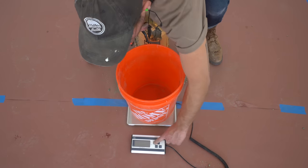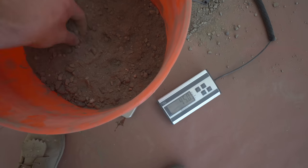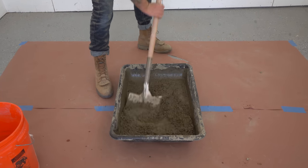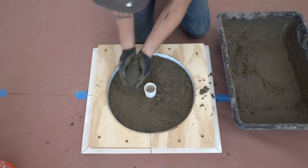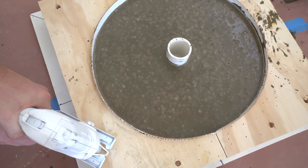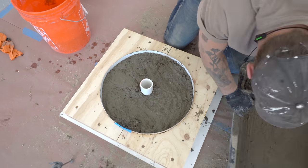For each plate I'm measuring out 45 pounds of original Quikrete — I want to use the most standard concrete available for these tests. I'm sure using a crack-resistant mix or adding fiberglass could help, but I wanted to try something not complicated first. After I had exactly 45 pounds of dry mix, I added water gradually so I wouldn't add too much. I added the concrete into my mold by hand so I could press it into the corners and all of the letters, trying to use 100% of what I mixed so my two plates would be as similar as possible. Pro tip: the jigsaw is the ultimate tool for removing air bubbles in concrete molds. For the second pour I added water a little slower, getting a slightly drier mix, then packed it in by hand and vibrated out all the air bubbles with the jigsaw again.